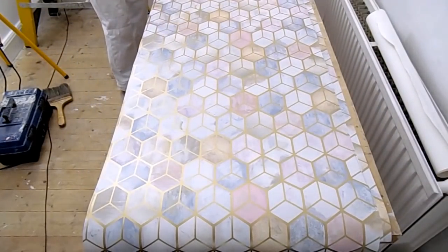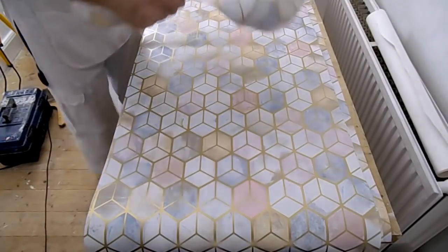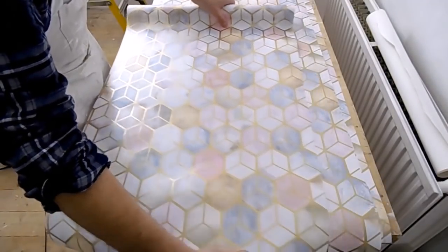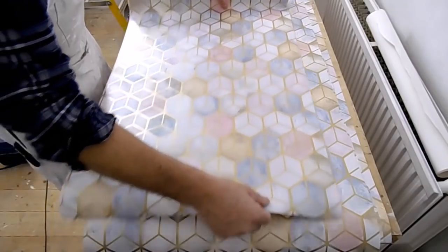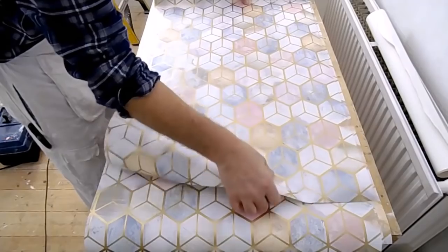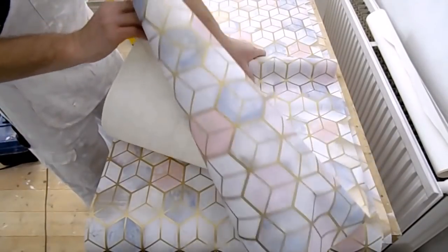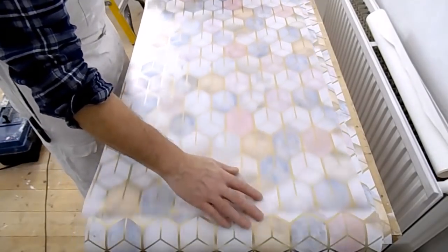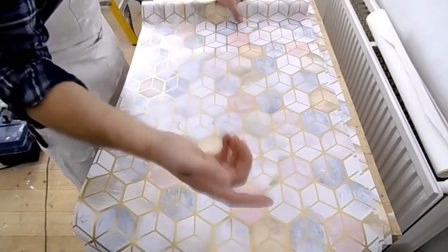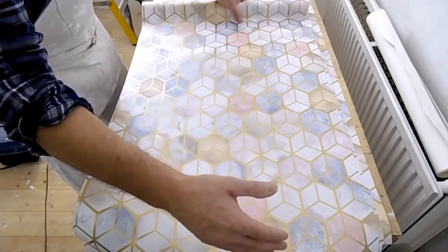Generally, you're not going to waste that much. So that will always be your second piece, which I'm not wasting that much. If I use that for my first piece now, there it's too short, and there I've just wasted all that paper. So that stays as my second roll. And that's how you work alternative rolls, so you don't have a lot of waste of paper.